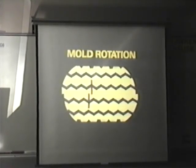Now, the tire industry is going increasingly to segmented molds. That's a mold that has pieces, think of it as a cake that's been sliced into 8 pieces, 8 sections of the mold. It opens and closes on the tire. And when it opens, it goes out at right angles from the tread. Instead of pulling up like that, tearing out the tread, it comes straight out from the tread. The mold comes straight out and then up. So that produces a better quality tire with the type of rubber compounds you're using. And segmented molds don't have mold offset.